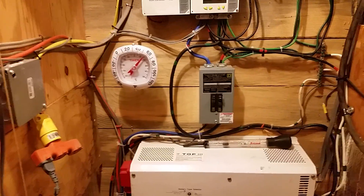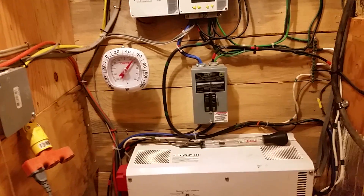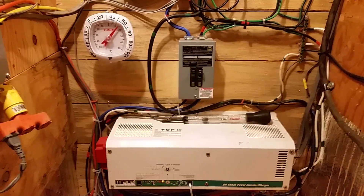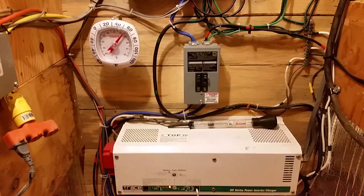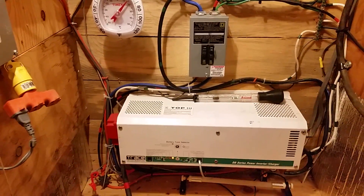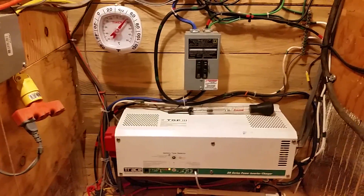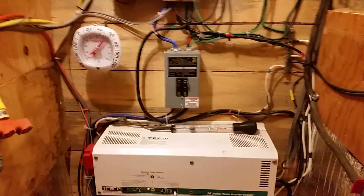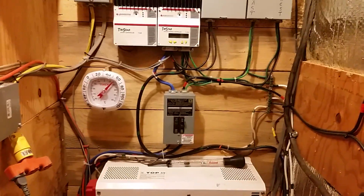My amp hours are down 6.9, and about every two seconds it goes down a hundredth — 6.96, 6.95. So about another 12-14 minutes and this should kick over into float. When it does I'll turn the generator off, turn the solar back on, and even on a gray day I'll have enough solar production to keep my batteries at 100% going into the evening hours. That's what happened yesterday and it worked great. Most times when I have more sun, I run my diesel generator and use the inverter charger to put 100 or 150 amp hours back in — bulk them good. Then when it goes into absorb mode I turn the generator off and let the solar finish it out, saving a lot of diesel. It's just too stormy today to do it that way. So the way we do it is run the generator in the morning and let what solar we have finish it off in the afternoon. Some people do it differently, but that's what works for us.